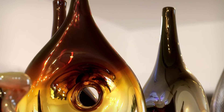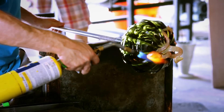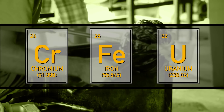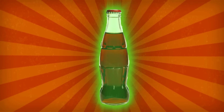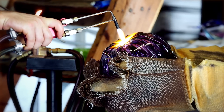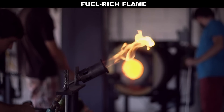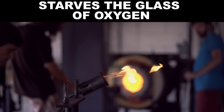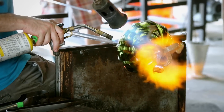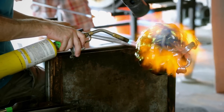In their normal condition these metals have a reflective sheen, but oxidize them by popping off a few electrons and they often contribute bright colors. Metals like iron, chromium, and even uranium can be used to color glass in shades of green, for example, although we do not recommend making radioactive soda bottles. The reverse process can also be applied: when these oxidized metals are present in glass, heating them in a low-oxygen flame can produce a spectacular effect. This so-called fuel-rich flame starves the glass of oxygen so electrons aren't gobbled up, leaving them to revert the metals to their shiny state and give the glass a mirror-like quality.